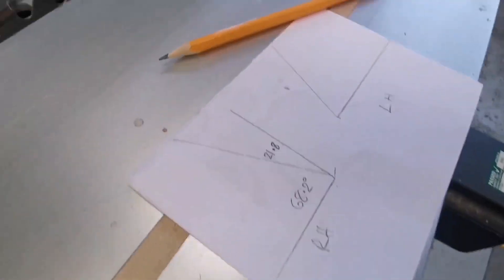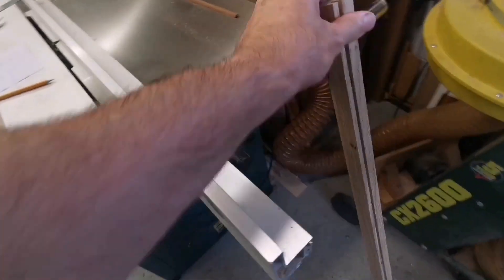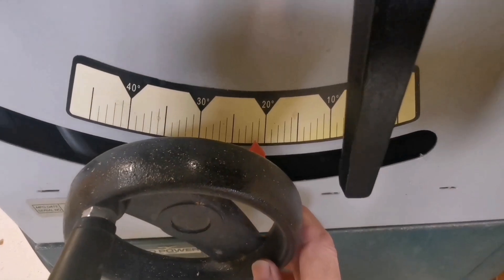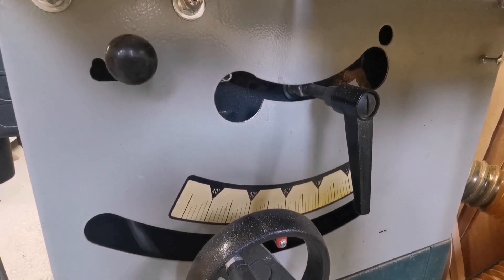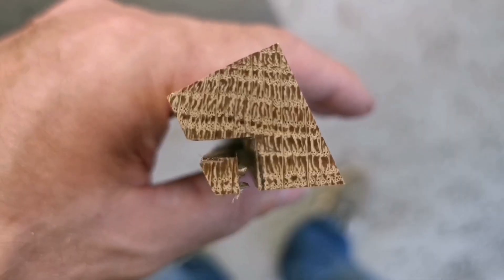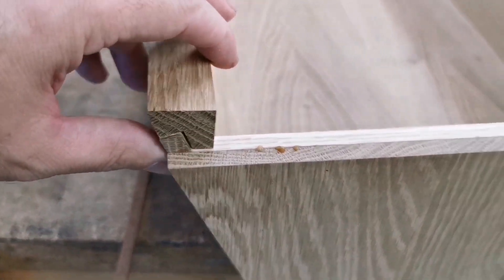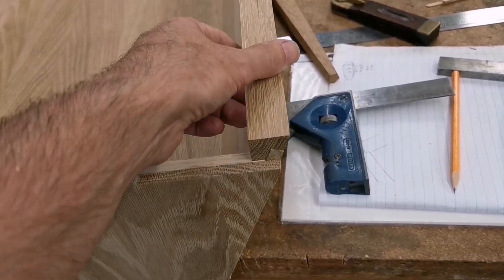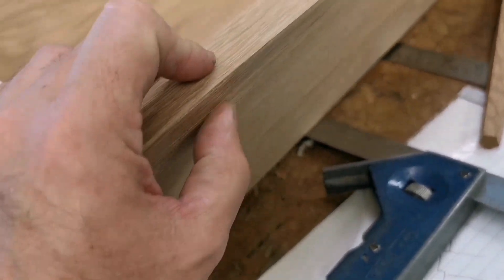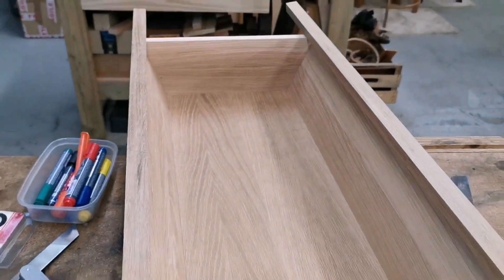Now I'm going to set the saw up — that's 21.7 degrees. I'm having to look where the pointer is; it's only a fraction under. Look, it's all cleaned out, looks great. Right, that's it. A bit of cleaning up to do, a bit of tidying up, but basically they sit like that. I know it's not straight — the timbers are bowed both ways as you've seen. That's looking really good, I'm pleased with that. Might have a little bit to plane off here, but that's fine. It means this becomes square and I can joint in the bottom rail, then make the door. Pleased with that.